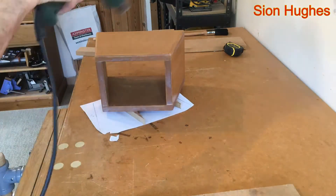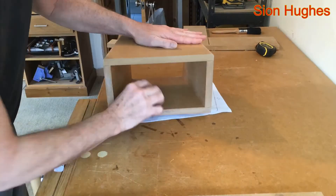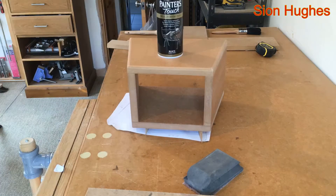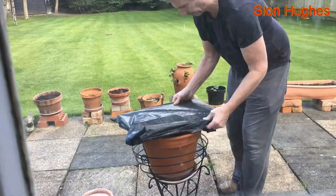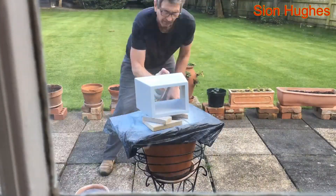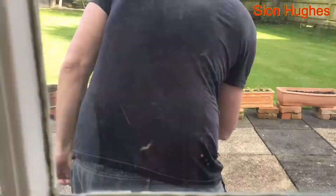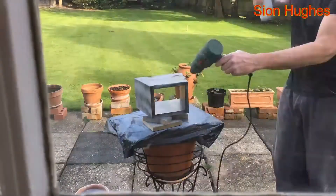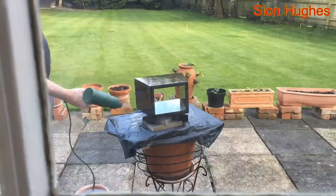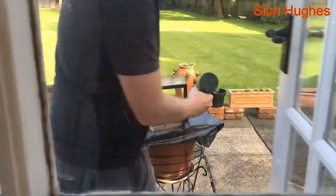All I want to do now is go straight back to sanding with the 320 grit. There it is — I'm just taking off all the nibs, then using the air gun to remove any dust. The topcoat primer is expensive stuff specifically used for spraying kitchen cabinets. It was a cold day outside so I'm heat gunning it as well as applying thin coats. I think it had about three or four coats of primer, then misting with black aerosol, heat gunning between coats, before one final pass with the aerosol to pick up anything missed.